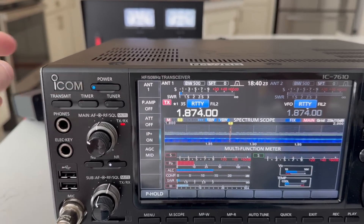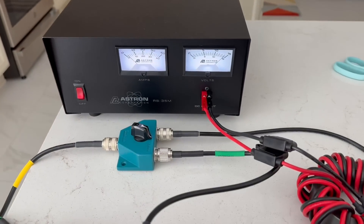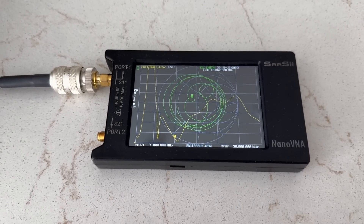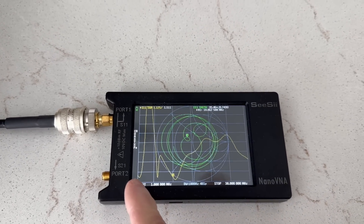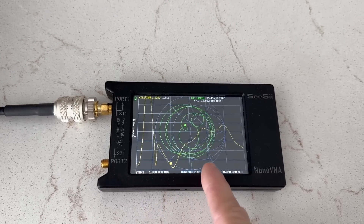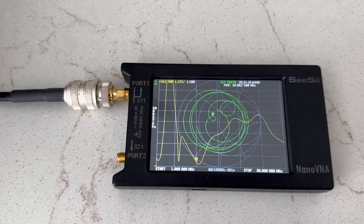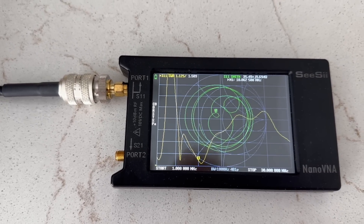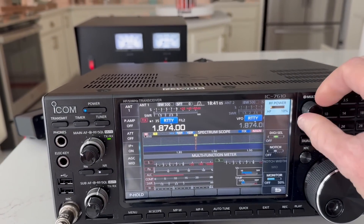It's just found the solution, so I'll turn transmit off. With an A/B switch I direct the output to the nano VNA and take a look at the tune. The scale is 5 megahertz per division starting at 1 megahertz. You can see this is right around 2 megahertz, and the tune is really good — a nice sharp peak, well below 1.5:1 SWR at 1.8 megahertz.